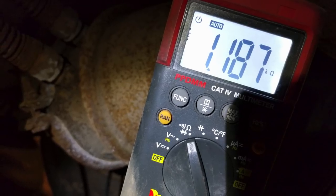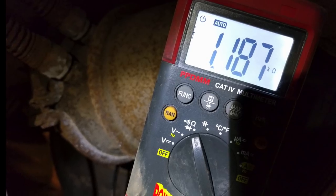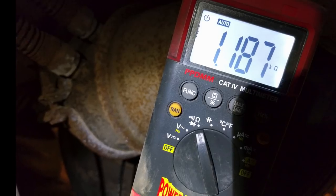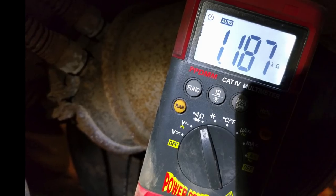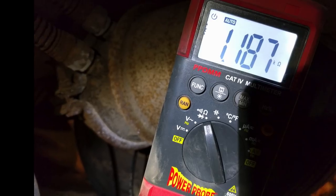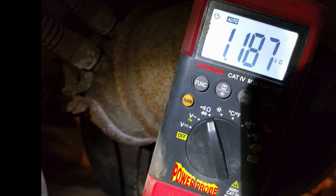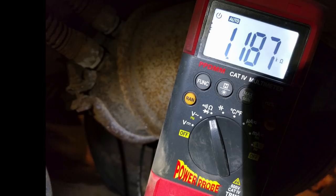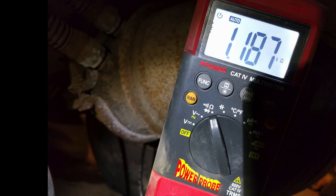To verify that you've done the repair properly and replaced the malfunctioning components, you need to either take the unit for a quick drive and reach a speed of at least five miles per hour, or jack up the axle and spin the tire to five miles per hour until the ABS light goes out. Remember, once you've done one repair, check your codes again — it always stores codes in sequence, so after fixing one code there may be a second code you won't know about until the initial problem is repaired.